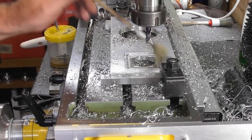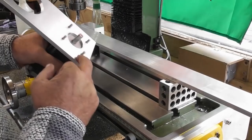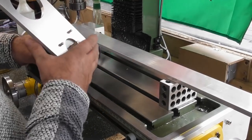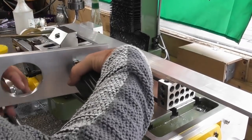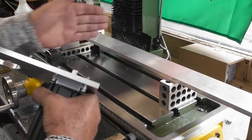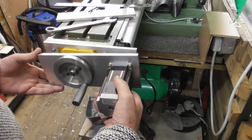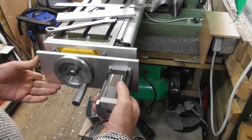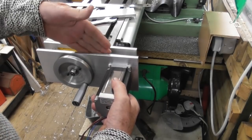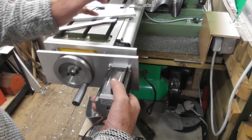So that's the plate done — the motor sat down in its little pocket. I've got to cut the bolts off — a little job on the lathe, simple enough. We've got the centres where we decided on the figure. So the next thing we're going to do is make the plate that fits between the one on the mill and this plate, to a set width. They're going to be 240mm long. You can see the sort of idea — the two pulleys and the belt between them. We need a spacer to go in here, so the next thing is to make that spacer.